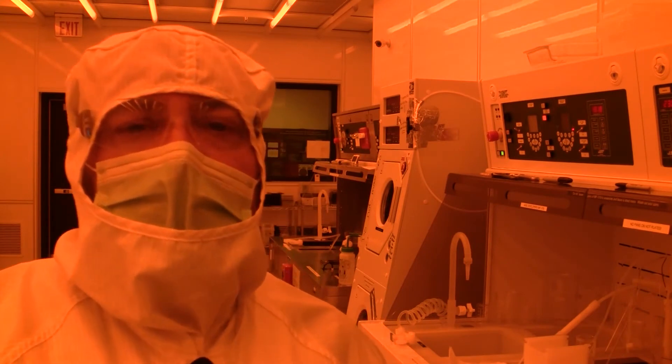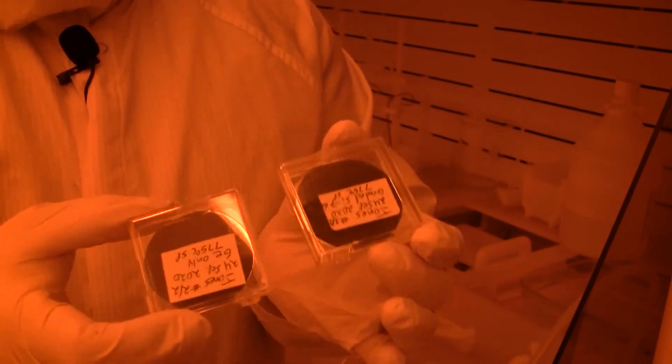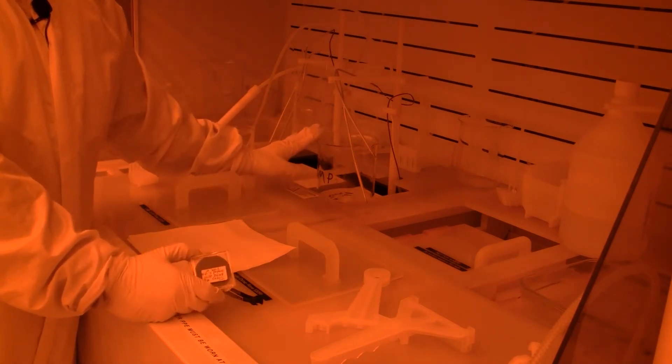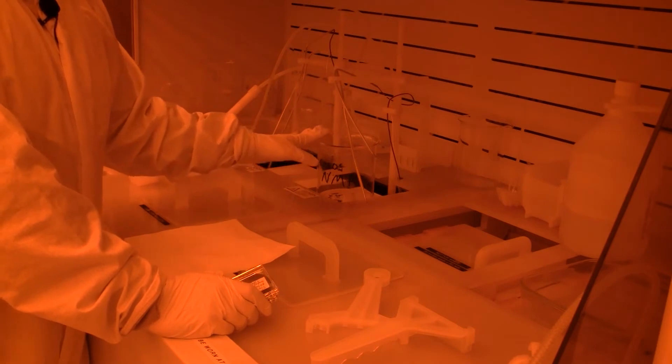I'm going to show you how we do this. I'm going to take these two wafers and strip the photoresist off of them. They've had the germanium etched. I'm going to use NMP. NMP works best when heated. This is a dedicated quartz beaker because I'm trying to do CMOS work — we only use quartz. You never use Pyrex because it's loaded with ions. Also, because we have a lot of other processes in this clean room that are not compatible with CMOS, it's absolutely necessary to have your own dedicated glassware.